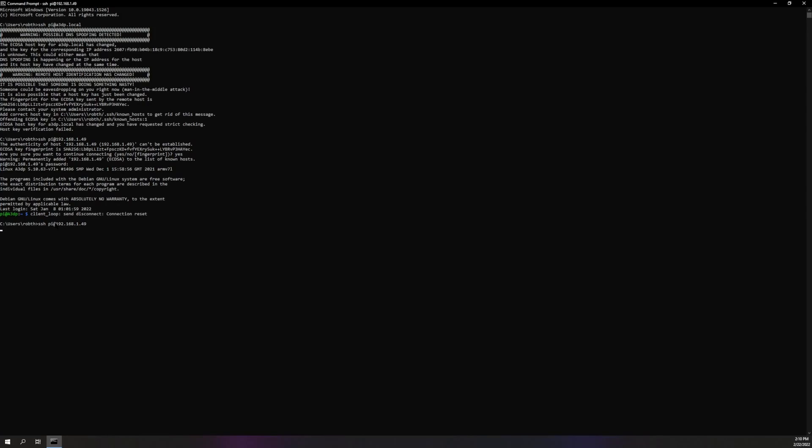Now I come back over here and I'm SSH'd in. I'm probably disconnected so re-SSH in. Now I'm gonna change to Klipper and run make menuconfig. A smart move to do while this is here is open up your printer in Mainsail and make sure you update Klipper first so you don't flash an old version. Now let me do the host process first.